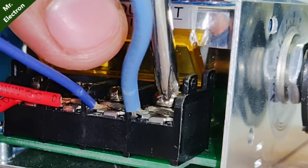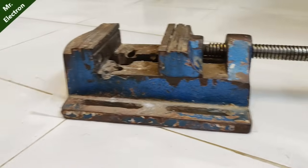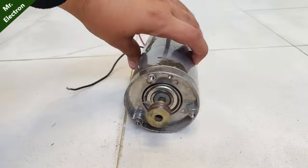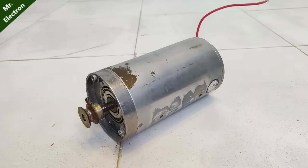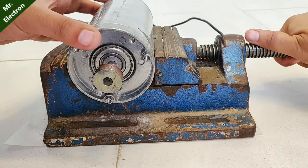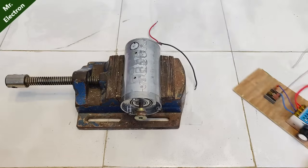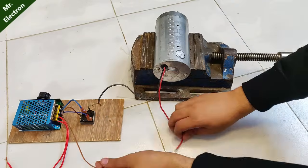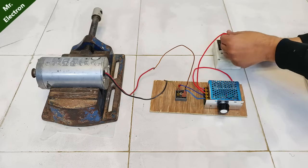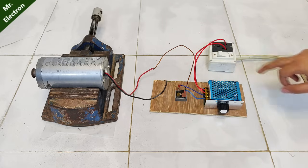The blue wire connections are now complete and it looks like this. This is a 24-volt DC motor that I'm going to use for testing this controller. I'm going to run it from 60 up to around 220 volts maximum — essentially forcing it. Since it is running freely with no load on the motor, it won't consume much current and should run easily without burning out.